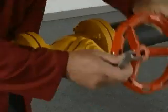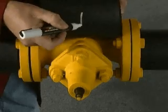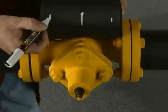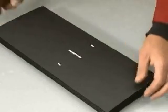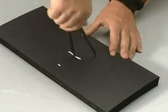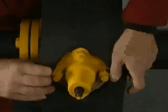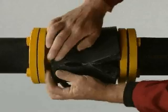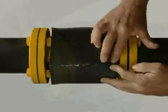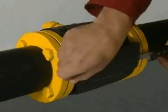Valves. Remove hand wheel or control lever to access valve. Start by insulating valve body. Measure projecting part of valve body with a piece of sheet whose thickness fills it entirely. Cut a hole in the sheet and pass the valve through. Trim to circular shape of valve.